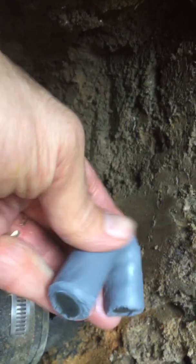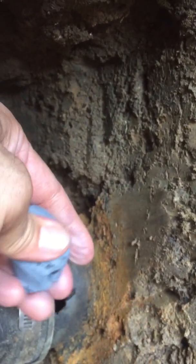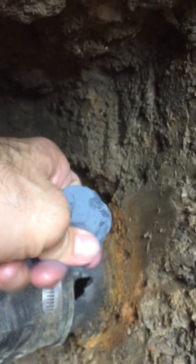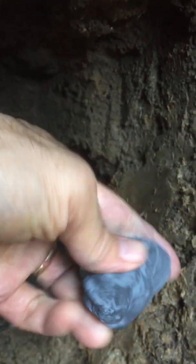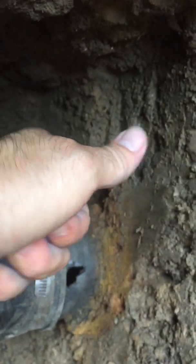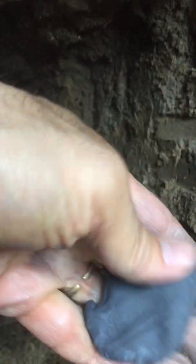I'm going to knead this now — usually epoxy begins to warm up. I'm holding it with my right hand and kneading with my left. What we want to do is really make a casement for the top of this pipe so that we can have a seal. We don't want dirt getting down in there, and we don't want the pressure of the dirt on top beginning to crush it. So we're going to case this in first with some steel epoxy, and after that's done we'll consider some hydraulic cement if we need a thicker shell to carry the load.